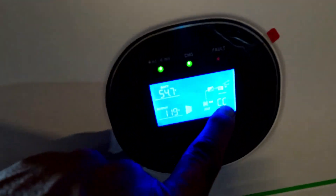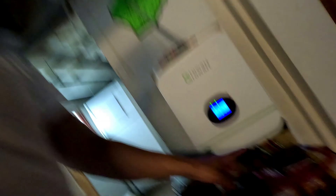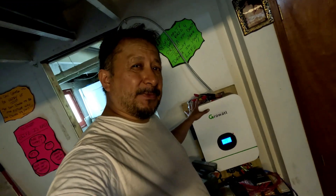The battery is in a constant state of charge. This is a 48-volt system — it'll go all the way down to 42 volts. It went up to 54.7, so we're doing good. The inverter fan is going on a lot more, and when the fan goes on, look at the reading.